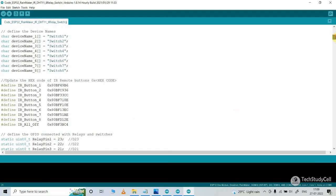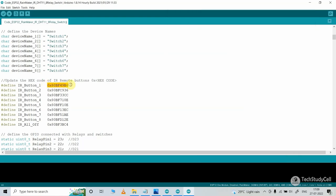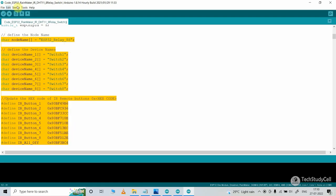After doing all this, we will update the hex codes of the IR remote buttons. Let me open the notepad file — this is the hex code for button 1; I will copy it and paste it here. In a similar way, update all the hex codes of the IR remote buttons you are going to use. Then if you want, you can change the device names — here I have given switch1, switch2 through switch8, but you can give any name like room light or study lamp. Alexa and Google will identify the device with this name. This is the node name — you can also change it, and under this node you will find all these devices. After doing all these changes, you can directly upload this code to ESP32. Go to Tools, select the board as ESP32 Dev Module, then in the Partition Scheme select Rainmaker, select the proper port, and hit the Upload button. These are the GPIO pins used for this project — if you want to change the circuit, update the GPIO pin accordingly. In void setup, I have set the timer interval to 2 seconds, so after every 2 seconds, if the Wi-Fi is connected, it will send the sensor data to ESP Rainmaker.